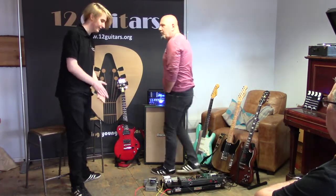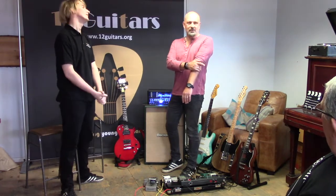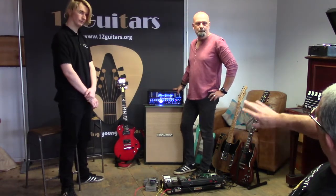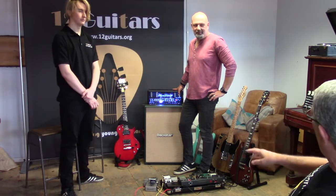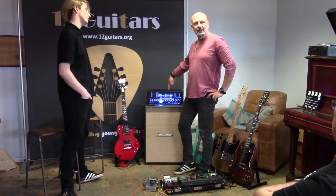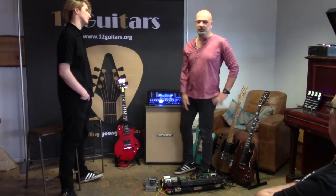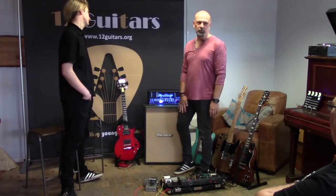Thank you so much for taking us through your rig. It's very important for young players to make sure they match the amp to the speaker. The rule is: low into high will fly, but high into low won't go — so 4 ohms into an 8-ohm cab will work, but don't go the other way. One of the reasons I love this amp is that sometimes you don't get a choice of what cab you're going into. This has an automatic ohm selector, so I can literally plug it into anything and it will work. If you're at an open-air festival and somebody hands you a 4x12, with this amp I can rock up anywhere, plug it in, and it'll just work.